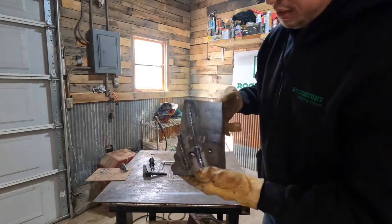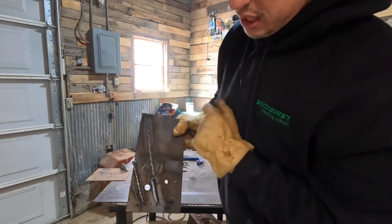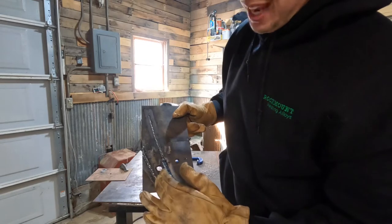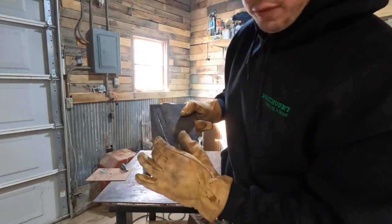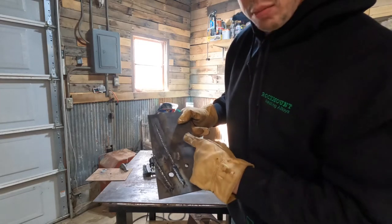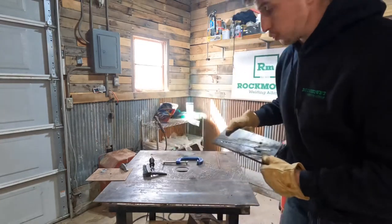Now with this product, you can see here we can get rid of the slag and you actually get a clean cut to it — get that little knob off there. Now if I wanted more depth, I can come in for a second pass, or I can even go through and add a little more depth with a little more angle to the rod. I was pretty flat with this, so we can go through and do that now.